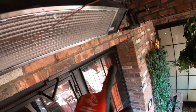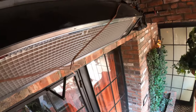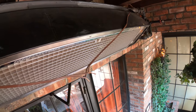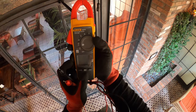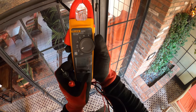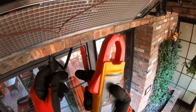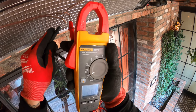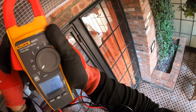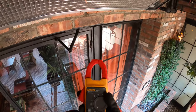Alright, so I still have everything disconnected. Coming from the transformer is going to lead in here. There could be other shorts, but right now I'm going to turn on the power and see if we have our steady 24 volts. Fixed these two wires — spliced them. Tell me we got 24 volts. Right there, see that? We got 26.3 volts. We got our 24 volts. It's steady — that means our transformer didn't trip. This was the problem.